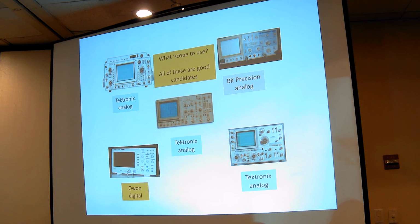And they should be all of the same brand and the same type. These are Tektronix brands here. The ones on that scope came with the scope, and I have others with me, like Hewlett-Packard, and they're used interchangeably. You can use the Tektronix ones on that scope, and on the HP scope, they almost all have the same input impedance. And what do these things do? Well, they couple the signal probe to the scope.